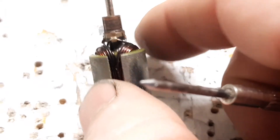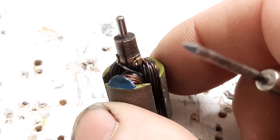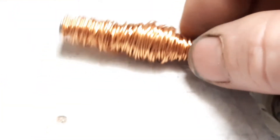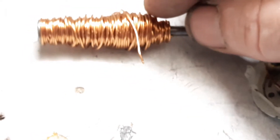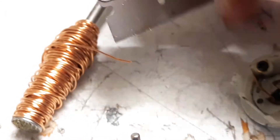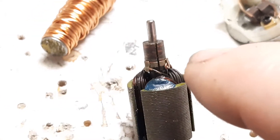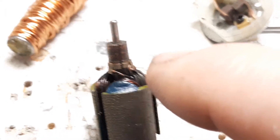It's probably going to break on you, especially if there's a pocket. You're going to have epoxy on it — this one might have epoxy on it because it was balanced with epoxy. Before you start, you want to take your fresh copper wire — this happens to be out of a three-way crossover network. Take a razor blade and trim away some of the clear coat resin, scrape it all the way around: bottom side, top side, sides. Put a little solder on it, put a little solder on your tab, whatever tab you start at, solder it in place, and then start your windings.